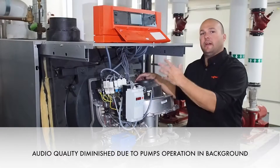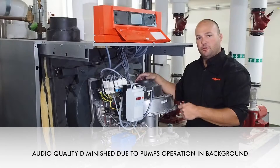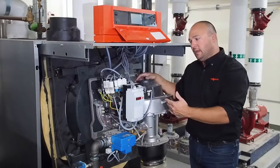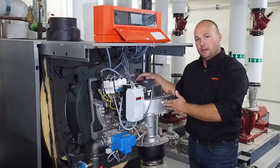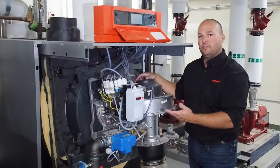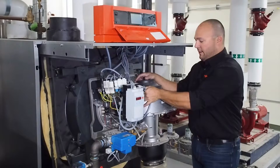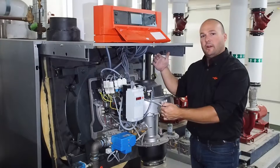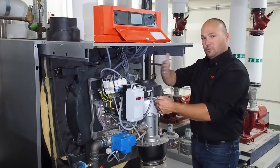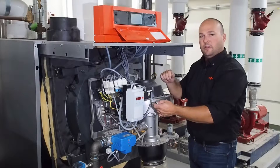First, make sure the heat exchanger is nice and clean. If it's dirty and dusty, hose it down with fresh water and let it run back through the condensate and out through the back of the boiler. Next, check if the burner tube is dirty. If it is, make sure the power is off, unplug your signal wire — the fan will then run in high fire when you turn the power back on — and lightly hit the burner tube while using a vacuum to get the dust off.